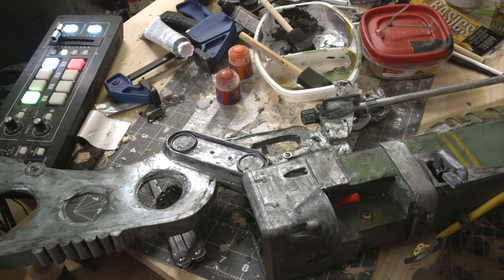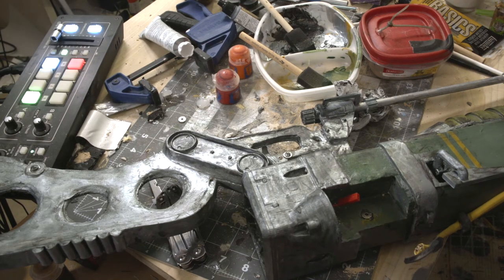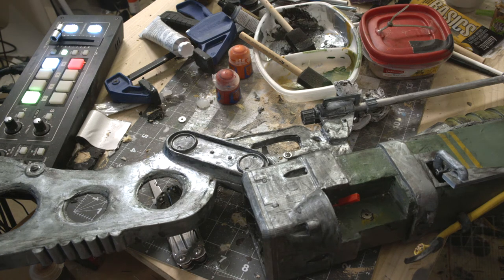Let's talk about the two big parts that are not 3D printed. The first is the stock. The stock and the backbone that runs to the rifle attached to the stock are quarter-inch plywood covered in EVA foam for added detail. The reason this is not 3D printed goes back to the same issue as the metallic rod — it's very long and very narrow, which is a great way to have something snap. The stock is what keeps the rifle straight, so you need a straight piece to ensure everything attached to it lines up. Long 3D printed parts tend to get a little crooked if not designed right. Also, using the stock against your shoulder puts stress on it, and you want decent structural strength so it doesn't break when carrying the prop around.